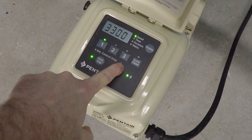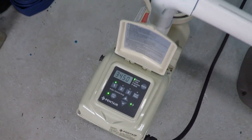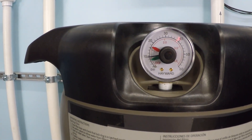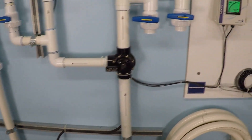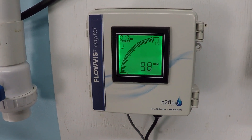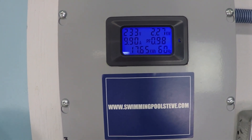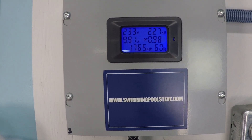This will be the maximum RPM. System pressure is just under 10 PSI — I'd call it 10 PSI. At maximum speed we're seeing 97 to 98 gallons per minute and 2.26 to 2.27 kilowatts, just under 10 amps of current draw — that's 2,270 watts.